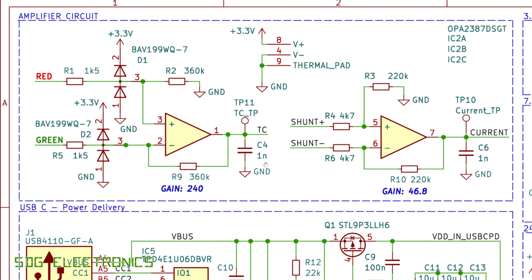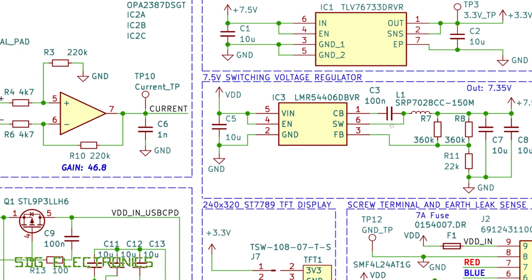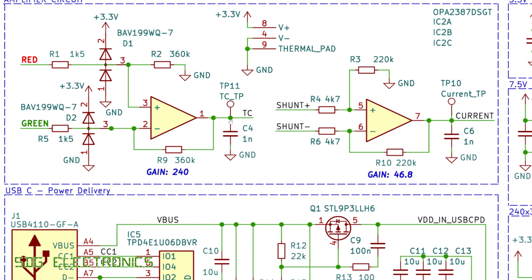The other more serious problem is a capacitor on the output of an op-amp — you should typically never drive a capacitive load with an op-amp if you can help it. What can happen is gain peaking at high frequency just before the roll-off, which causes a phase inversion and leads to positive feedback through the feedback resistor, causing oscillations and uncontrolled op-amp behaviour. One way to resolve this is to put a small series resistor in series with the capacitor to decouple it. Really the capacitor is only there for charge distribution during ADC readings — you should be fine driving the op-amp output directly into the ADC, or just adding an RC filter.